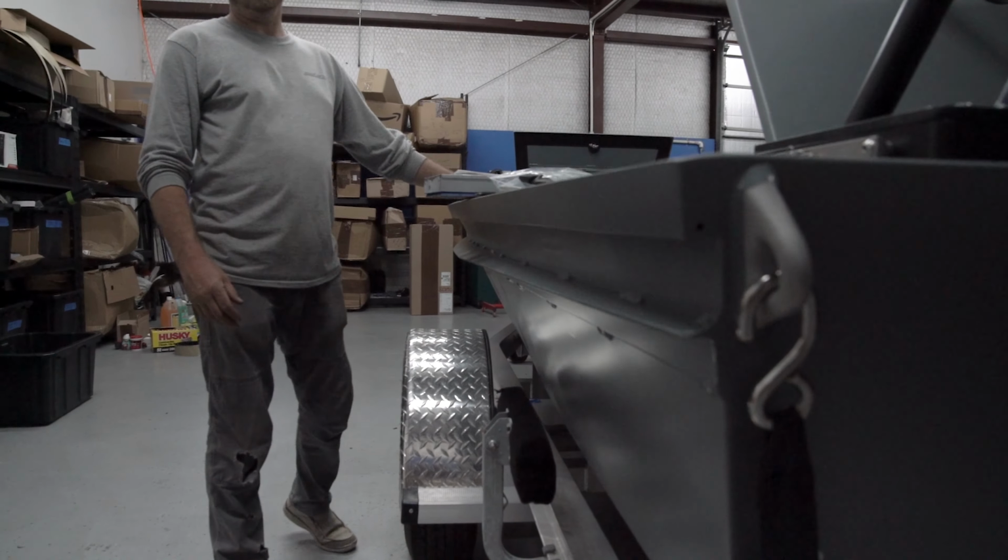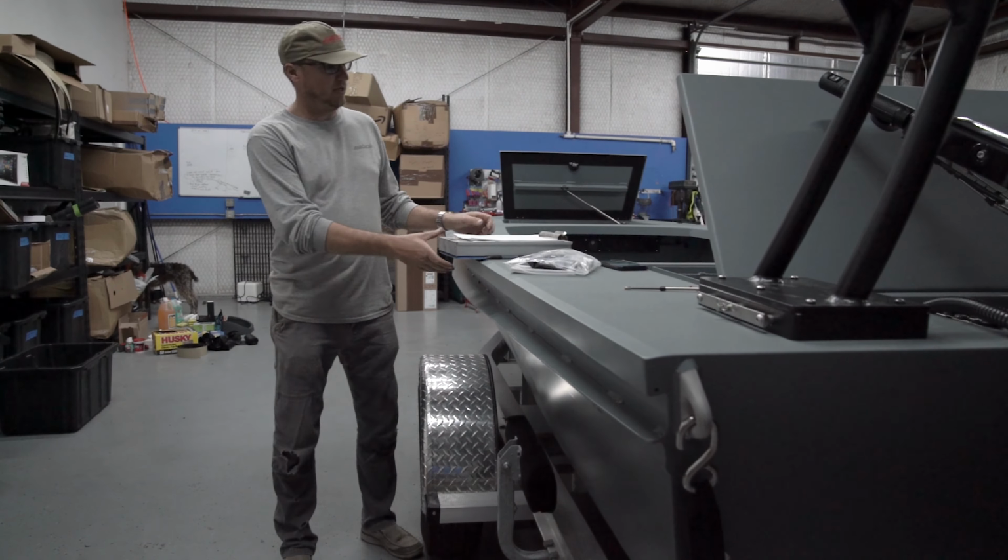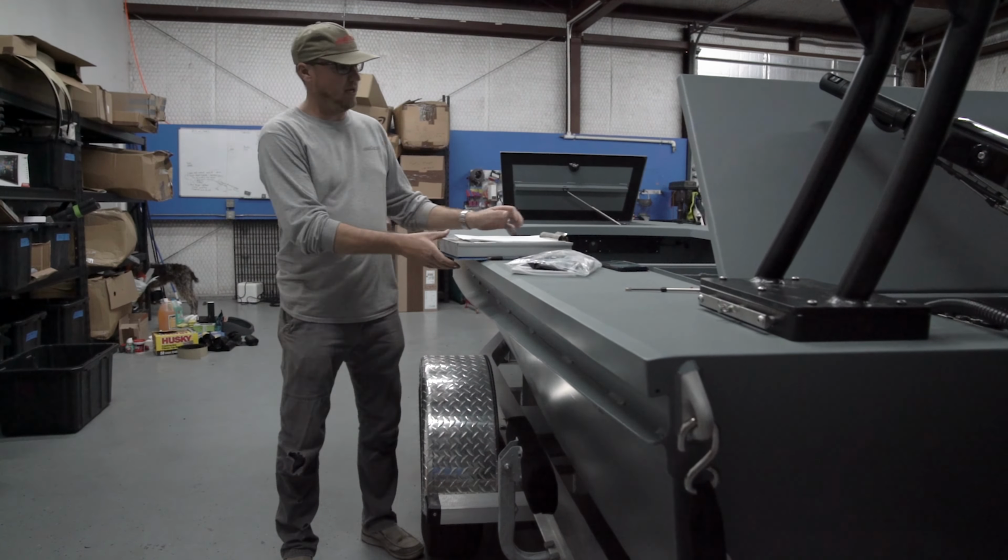So one thing you'll see different on our River Skiff versus the Versatile right beside us, the River Skiff has 6 inches more freeboard than our Versatile, 8 inches more than our Micro. We do not have the rolled gunnels on our River Skiffs. So we weld in a 1x2 channel along this skiff, and it will get a rub rail mounted in reverse, so the rub rail will lip over the top, not underneath.